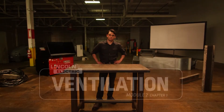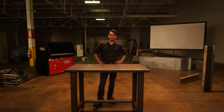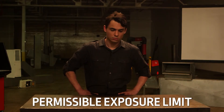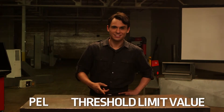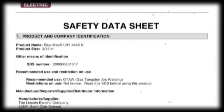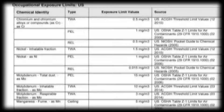It's all about exposure. There are guidelines for how much exposure to potentially hazardous chemicals is acceptable. In the US, OSHA has created the permissible exposure limit, or PEL, and ACGIH has created the threshold limit values, or TLV. This information can be found on the SDS, and keeping your exposure below these numbers will keep you safe.